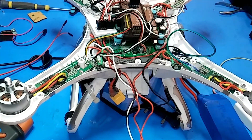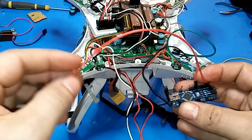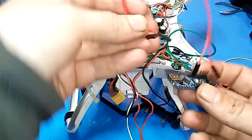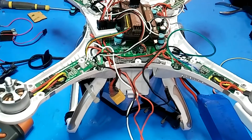That's it for my fix - hopefully I didn't babble on too much. I originally tested it with an Arduino, just adding some code to check the PWMs by plugging into the motor outputs. So if you don't have the same kind of APM, you might want to try something like that - it's really easy to do. Thanks for watching, like and subscribe, and I really hope this helps you guys out. Now I can continue on with one of my last videos for the CX-20.